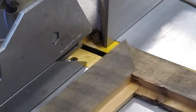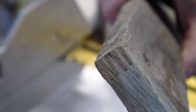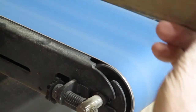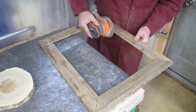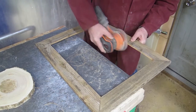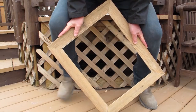Once the glue is dried I cut off the tabs that stick out past the corners. As a final touch up I gently sand the corners to get a nice smooth clean edge. I also sand the inside edge of the frame to remove any potential rough edges. If you ever wonder about the advantages of a finger joint — its strength — I would never do this with a regular standard frame. Do not try this at home.